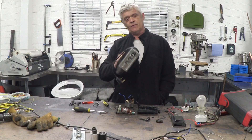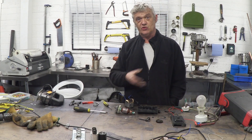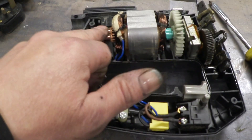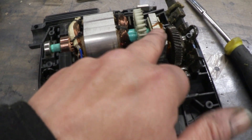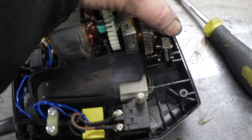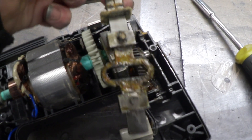I'm going to use a jigsaw because I have one here and a broken one. The motor in the jigsaw is identical to the motor in all those other bits of equipment. So there's the top front off — there's the on-off switch, the start capacitor, the lead coming in, the motor stator, and here's the rotor with the commutator and brushes. There's the rear bearing, a fan, the front bearing, then it's connected through a worm to a cog. That cog has a peg going onto it connected to a bit of metal — that's called a scotch yoke — which turns rotational motion into an up-and-down motion. That's how your jigsaw works.